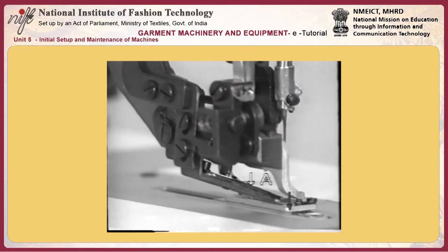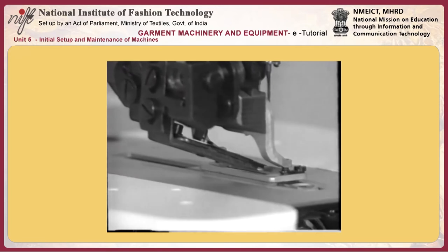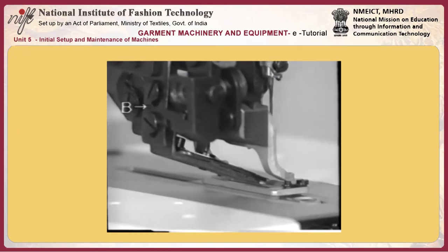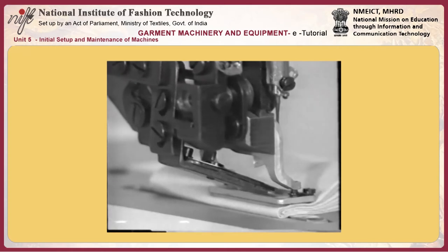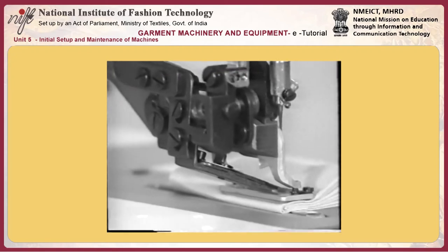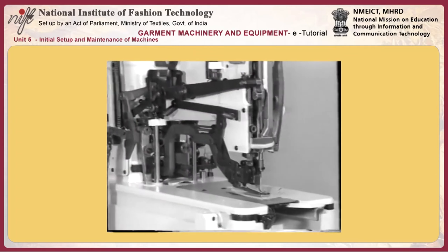13. Position of low speed cam J. Dimension A should be changed in accordance with the number of stitches to be used, to adjust the number of stitches to be sewn at a low speed till the machine stops at approximately 7 to 10. If you shift the low speed cam in the direction of the arrow, the number of stitches to be sewn from the start of low speed operation to the stop motion will be reduced. Adjust the number of stitches by shifting the low speed cam.